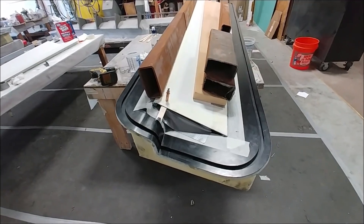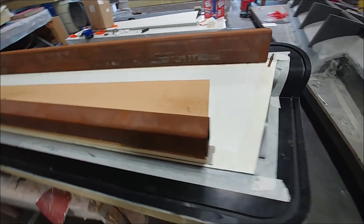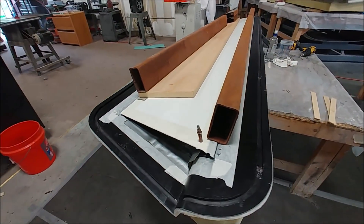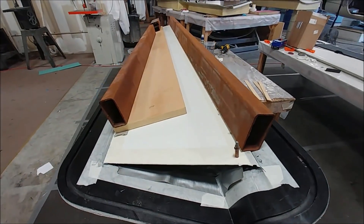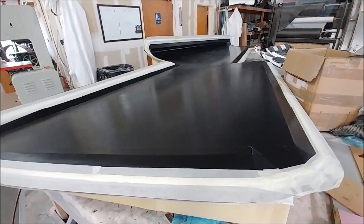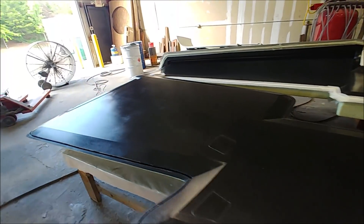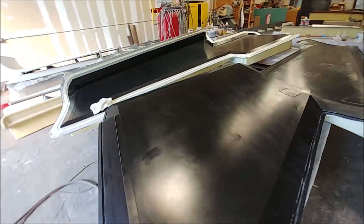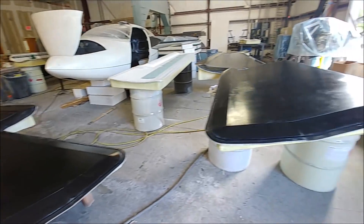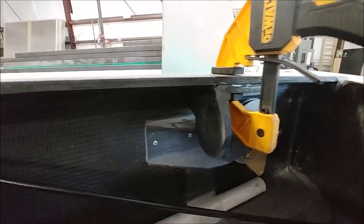When I got back this evening, Jeff had finished bonding in that first skin and closed out the first aileron. He's got some two-by-four steel on there holding it down so it stays compressed while the Hysol sets up — one down. The guys have also moved the four large wing skin molds from storage down to the main shop, and Keith is busy waxing them all up. It won't be long before Jeff will be cutting core for those and getting those skins made — super exciting.